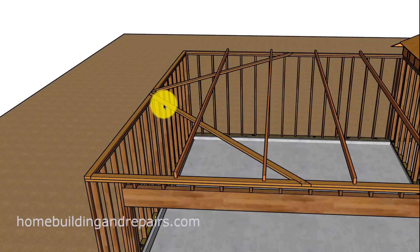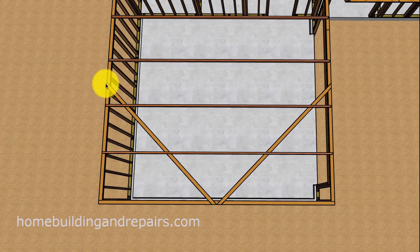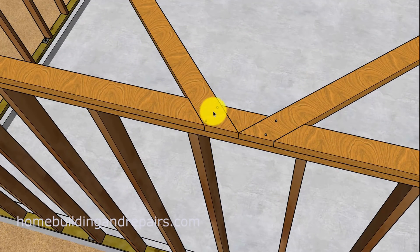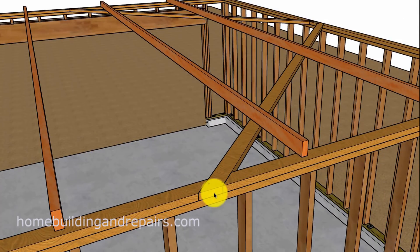I think you can just apply a little bit of common sense here. You don't want this to move — you're going to need some type of structural support to prevent it from moving. And they're usually cut into the top plates also. You're usually going to have something cut into the top plate and the rafter ceiling joists. The rafter ties are going to go on top of them, and of course they will just connect to the middle of the wall.